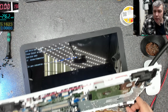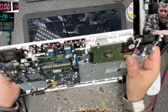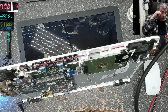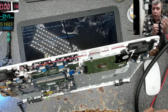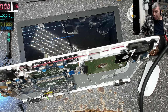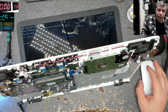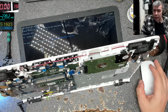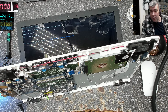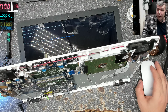But it's okay. So I think this video will end now, for a simple reason. It's working. It's your choice how you fix this. If you have more time to spend, spend more time, find exactly the problem, replace the MOSFET. Do whatever you think is right. But I will stop at this point. It's a 15 minute job, the price is quite low, I know what that MOSFET is doing, the laptop will be fine without it.